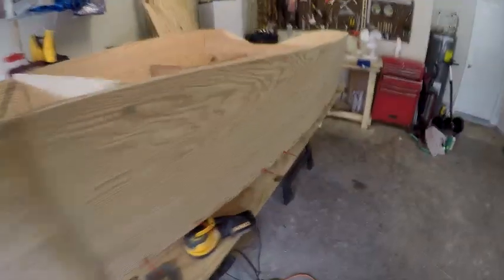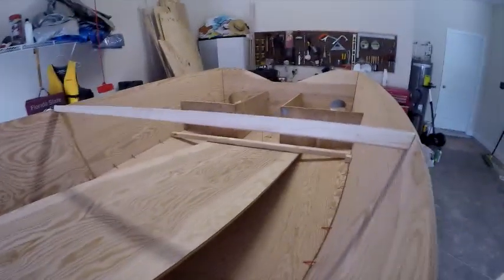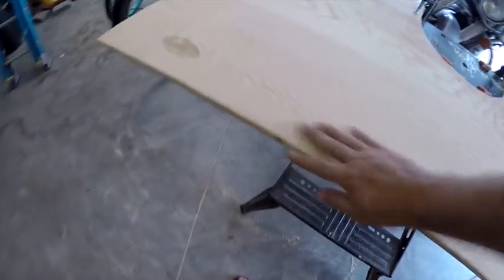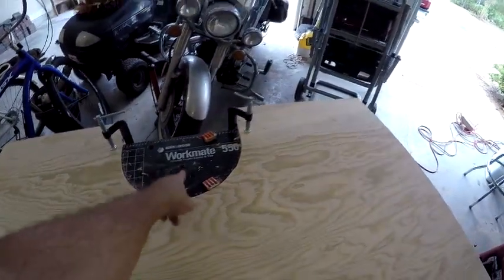Made a lot of progress. I lifted up the sides; the hatches are in place, here's the floor — the sole — and the forward bulkhead, all in place. I also have the stern seat in. I went around the corner with the router using a round-over bit to make it nice and comfortable, since that's where people will be sitting and where the fuel tank lines will go.